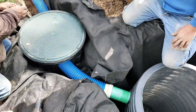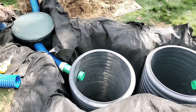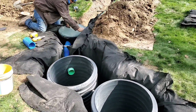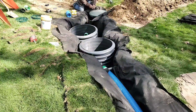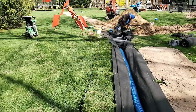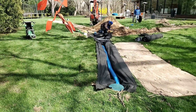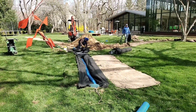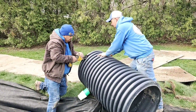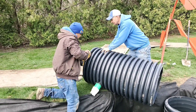Probably about 40 feet of leech line. We used some armor pipe to connect to the D-box because we had that little bend to make, so it created a real nice sweeping, soft bend. Beautiful soak away. Now this can load with water — and it's at an elevation where the ground can take it in and wick that water as it works its way to the lowest point of the yard. If you build your soak away right, gravity will do all the work for you.